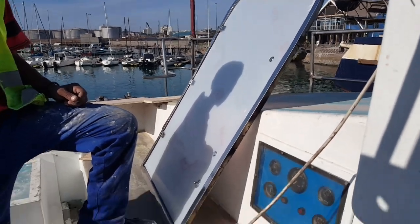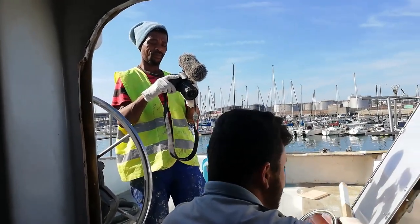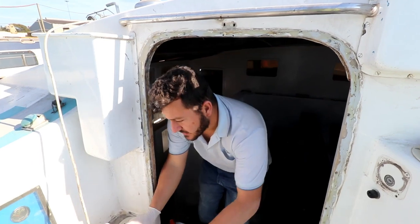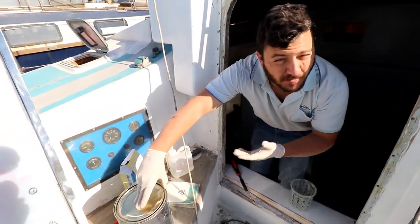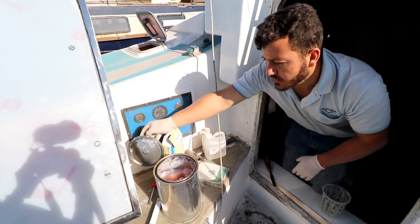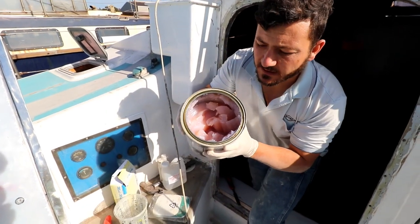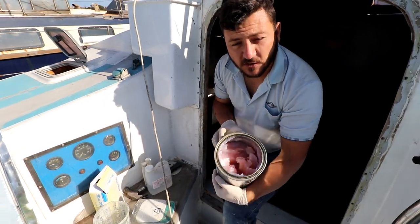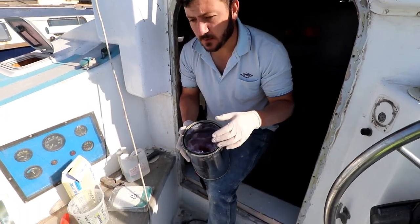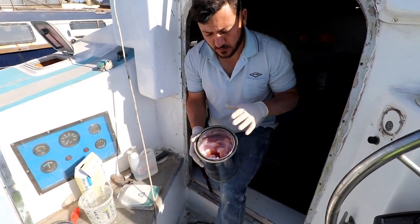There's a new beautiful door - it's an awesome door. Let's get to it Moses. We've got a new cameraman in town! So Moses is my cameraman today, Simone's busy editing. We're going to show you guys this stuff - you can buy it from NCS Resins, otherwise it's called a polyester bonding paste. The stuff is super strong, you can apply it thick. It looks like a pinkish paste. This one's got a bit of flex. You get another one which is a grayish color - it goes dull, it's not flexible at all and cracks up quite easily. This stuff has very little flex but is super tough and super strong, and we'll just grind it down afterwards.